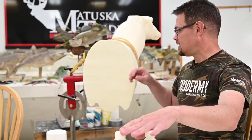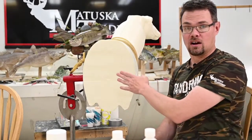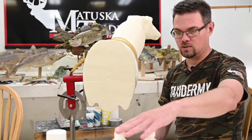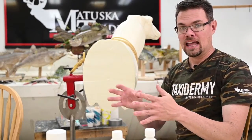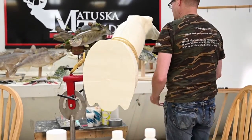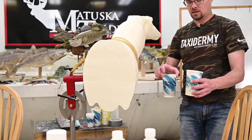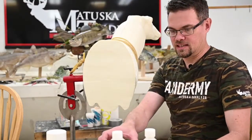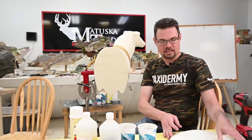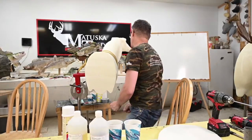This foam is, as you saw, we cut it. You can scratch it easily with your finger. We can carve and sand this foam, and it works really good. So we like this for our alterations. We'll do it for attaching pieces and parts together, and we'll also do it for extending the backs. So we've got a little bit poured off already here into cups, and we'll just pour out of that one. We've got 5-gallon containers of it with little pour spouts, which makes it nice and clean. But we're going to mix.